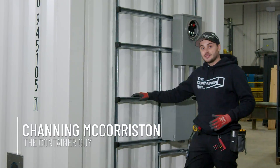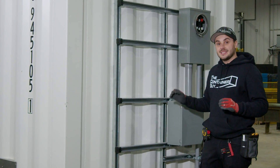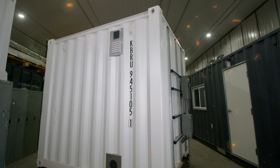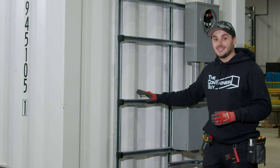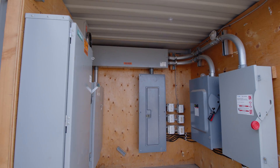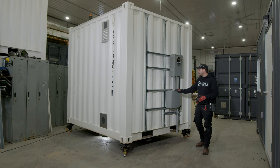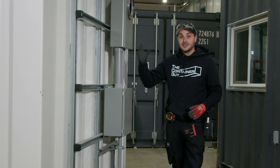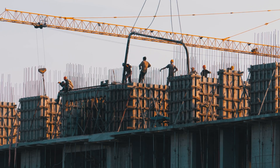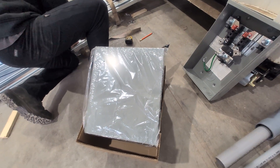We're going to build our entire electrical service here in Saskatoon in our shop and ship that to our other location and commission this thing. This is fireproof — a steel shipping container that can no longer light up, and it should last the test of time over at that site where it's rough and cut. E-houses such as this are becoming a very common solution. We actually build some of these and rent them out. A lot of construction sites want temporary power and they're a great solution for that. They've got fork pockets, they can move all around the site, and our local utility provider can actually roll in and give permanent power with a meter to a temporary site. This works well especially when they're at universities or hospitals doing a two or three year long construction project. You now can control your power — you're not renting plugs off the neighbor.